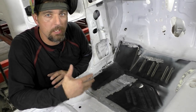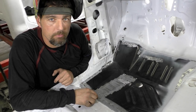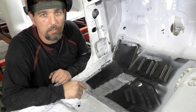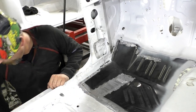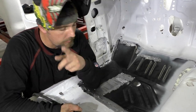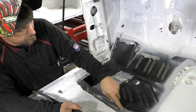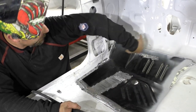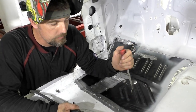We made sure our gap is really good and we're going to go ahead and MIG weld it. I have TIG welded and I do a lot of TIG welding on the channel, but for something like this on a floor pan, it's just not worth the effort. With the impurities and everything, the TIG welder is just not as efficient as a MIG welder, and when it's all said and done it will look about the same. So let's fire up the MIG welder. Megan, my wife, is going to try to use the welding helmet on the camera. We're going to start here to make sure this edge is all level first — just tack it and start running up our sides.